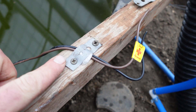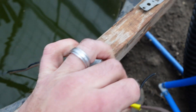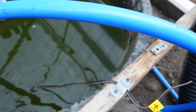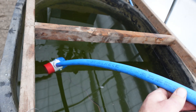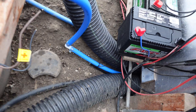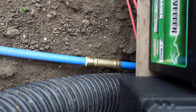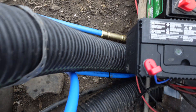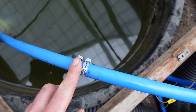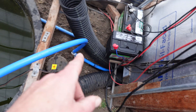Over here I just have a little piece of wire hanger with a small piece of foam, and I pinched our wires down underneath that to protect them and keep them from falling in the water. We've got our pump at the bottom, our first connection, our second connection which cost us $3, and then we've got our $20-$25 shark bite fitting. The shark bite is super easy — you're paying for convenience — and it might actually outlast the barbed connections.